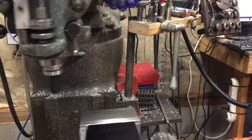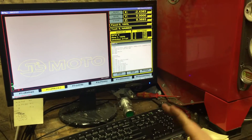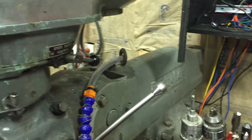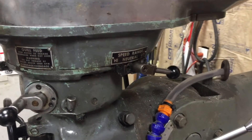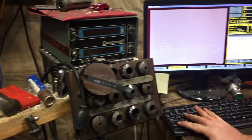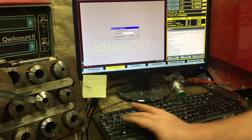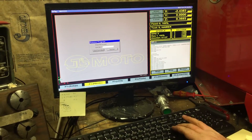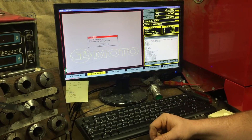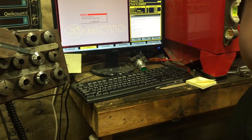All right, F2. We've got everything loaded — the program's loaded there. On this we don't want the engraver spinning, so we just threw it in the back gear only on the mill in low so we can get it to stay still. We're gonna do a Control S and it's gonna take off and start on line zero. We're gonna have to change the tool number though, which stinks.